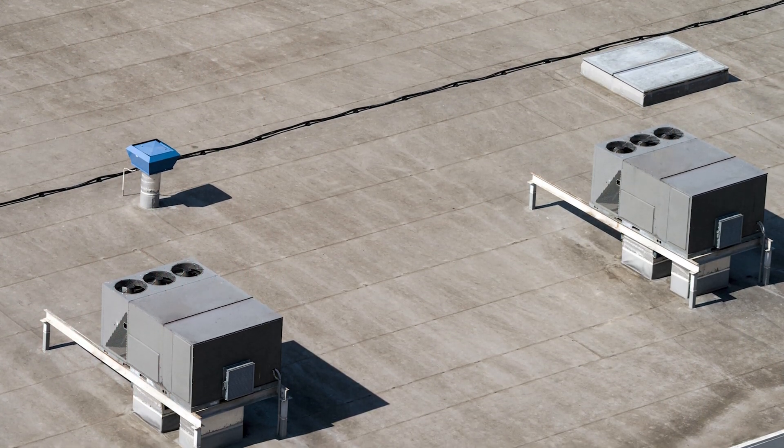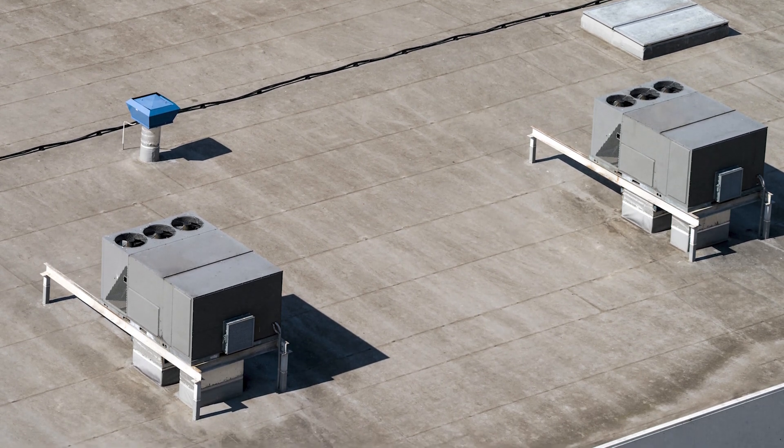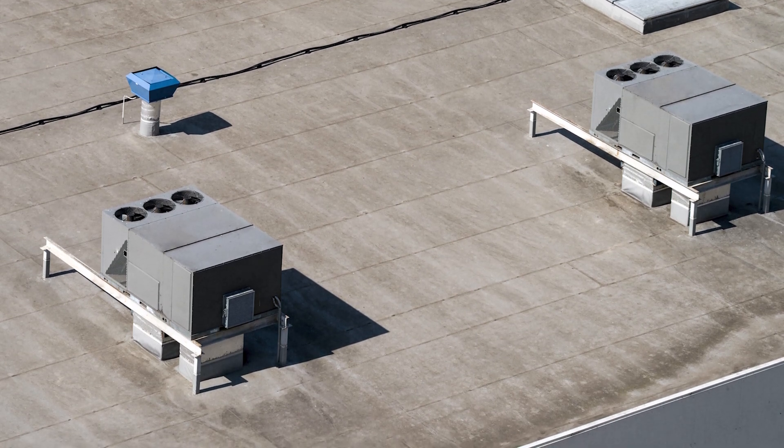Metal is used in almost all types of roofing — trims, flashings, and things like that. It's oftentimes concealed. When it comes to a flat roof, you'll have the flat roofing system in the field — that can be any number of systems: EPDM, TPO, PVC, and so on. The technology has improved over the years, but metal has remained relatively consistent on the perimeter, edges, and penetrations — flashing around what we'd call a curb. By and large, it's considered a flashing-type item for a flat roof.